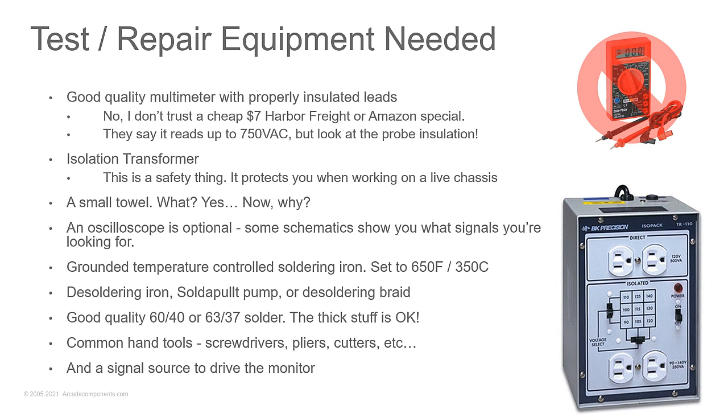Also, when you have leaking caps and you go to desolder them off a board like an old Macintosh or if you're into the PS2s and you have to recap those boards or the hard drive or the floppy drives, you touch the soldering iron to the lead to melt the solder, you'll hear a little sizzle sound. That's leaking electrolyte. And then you go, ugh, because it will smell nasty. Fishmonger's dumpster or the dumpster behind a Chinese restaurant, where they serve a lot of fish. Yeah, that's the primary odor, fish. It's just really gross.